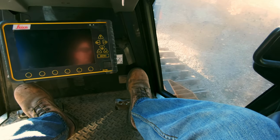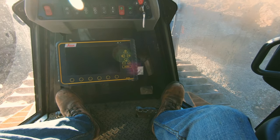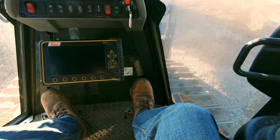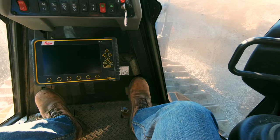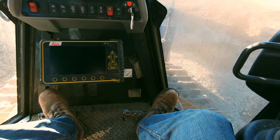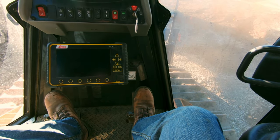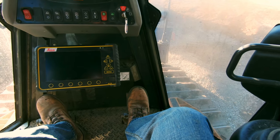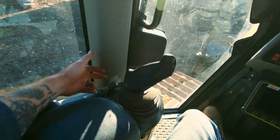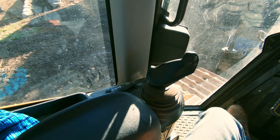Right here is what's called your decelerator pedal. Bulldozers work the opposite of cars — instead of a gas pedal, you have a slow-down pedal. It slows the engine RPM down. Most of the time when you're pushing you're running full RPMs, and you just want to slow down when going from forward to reverse or reverse to forward. Moving over here to the left, we have a hand throttle that runs full bore, and you use the foot control to control your throttle.